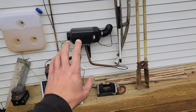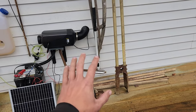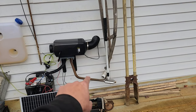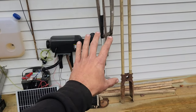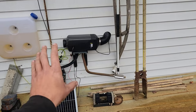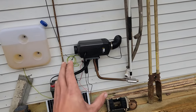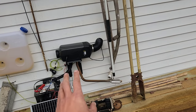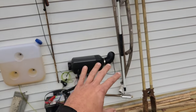There's one issue with this thing when it starts up: for some reason it makes a rather defined cloud of smoke out of the exhaust for the burner system. I think what I'm going to do is reroute this up and out — way up. Because as it is right now, in the morning when the dew is still heavy and moisture is heavy, especially on a foggy day, when you fire this up, this inlet over here — you can smell it pulling in diesel fumes. Once it's all fired up and clean burning, you never smell those fumes again. But in the interest of safety, I am going to reroute this with an extended something up into that region so that it blows way away from the whole setup.